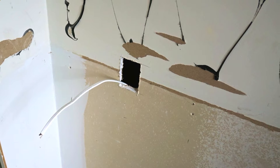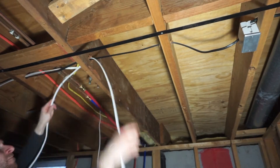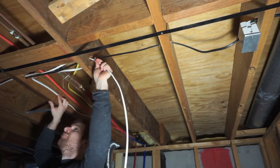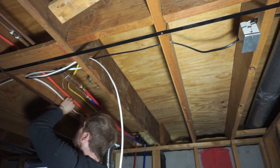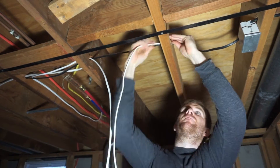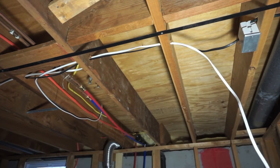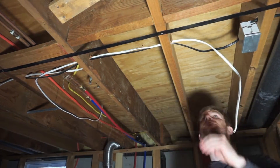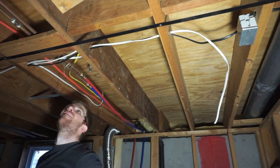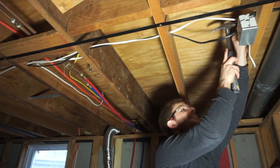Be sure to leave an ample amount of wire on the outside of the wall. Although you'll only be needing six inches in the box, leaving extra gives you a bit of wiggle room. Now you'll want to take the rest of the wire and route it to your closest junction box. There are standard rules for holes that can be drilled in floor joists that you can look up if needed — I simply used holes that were already drilled. Also note that when routing wire to a junction box, you should verify that the junction box has enough cubic inches to house a new wire; I'll leave a link in the description below.